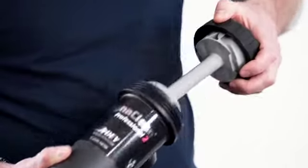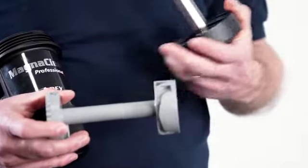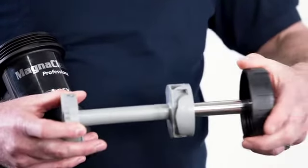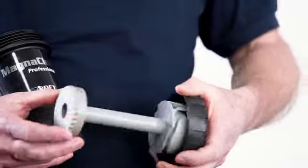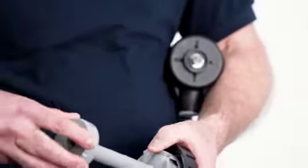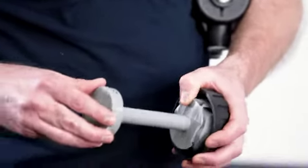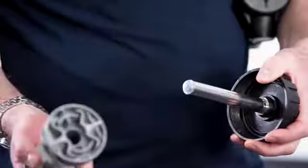It works on a very strong magnetic core and a plastic sleeve that sits over the magnetic core, designed specifically for removing any non-magnetic material, which is captured in low flow areas at the bottom and the top of this plastic sleeve.